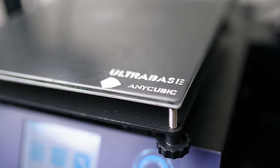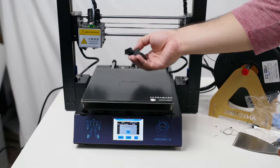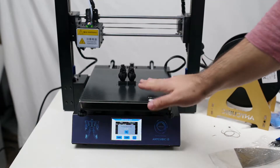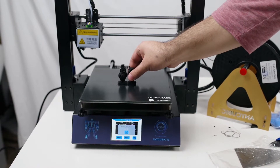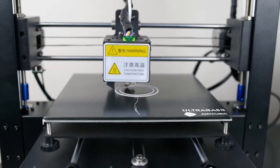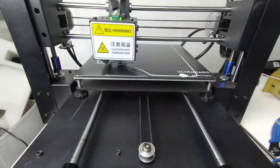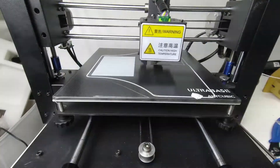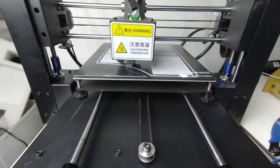Next on the list of unique selling points is Ultra Base, a feature so good that it makes removing printed parts from the bed as easy as just picking them up. No prying, no bending, no effort needed at all. That isn't to say it's perfect — you'll still need to wait for the bed to cool before moving the part. You'll also need to print the first layer a little slower and potentially thicker. For me, 0.1mm didn't seem to stick well at all. And small prints don't adhere very well, so you may need to use a brim if you find your parts being knocked over. But as a one-stop solution for adhering your prints, it's a great option.